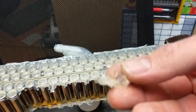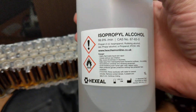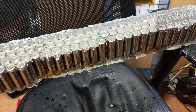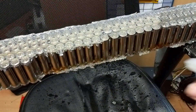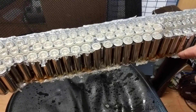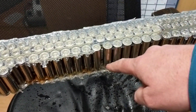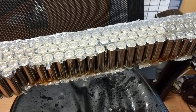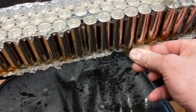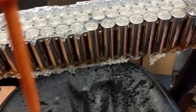Another way I've found to do it makes it a bit easier. I've got some isopropyl spray which I've just sprayed on. What this does is it actually makes this plastic stuff even more brittle and it loosens off the glue that's holding these cells in. So it kind of makes it a bit looser and comes off easier.